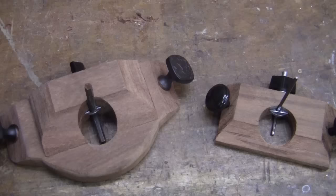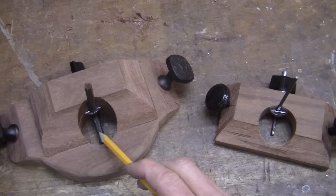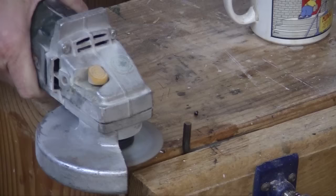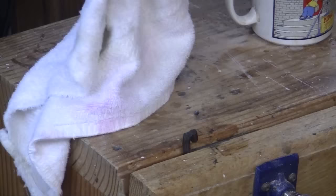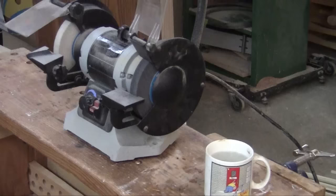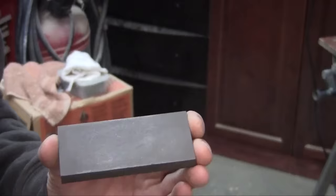For all intents and purposes, the router is pretty much done. But the wrench needs to be sharpened to make it a blade. The length has to be shortened too — use a cut off wheel and keep it cool with water. When shaping the angle of the blade, be careful not to overheat it and frequently use water to keep it cool. Now just take it to the stones and get it razor sharp.